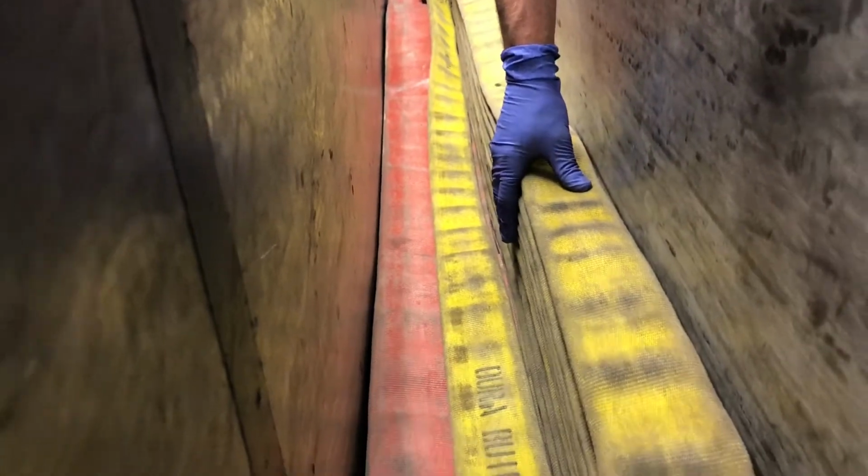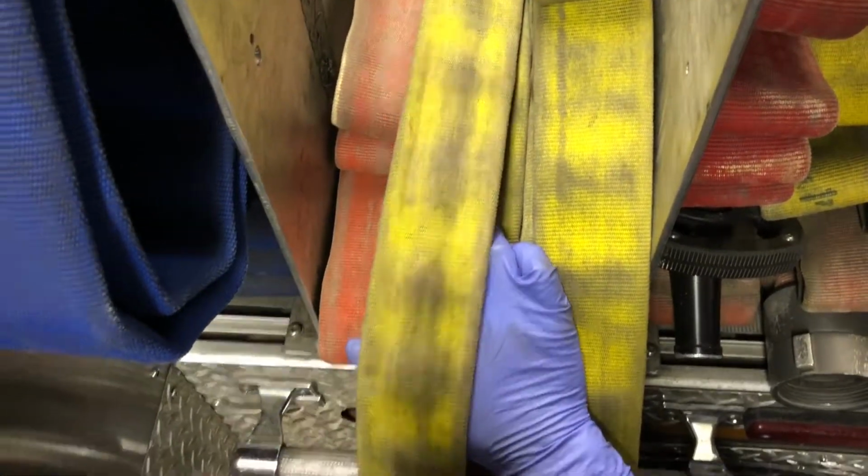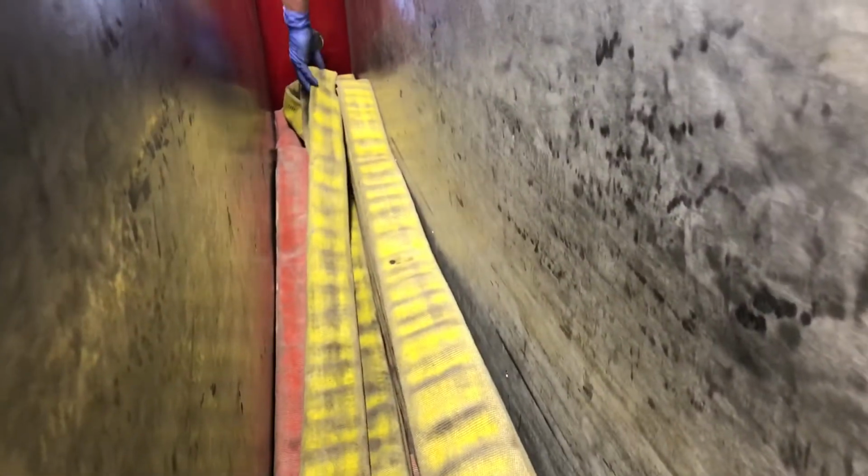The coupling in the back third, hose coming straight down the middle, following the same pattern. This stack is often the most challenging to load. It sits directly in the middle of the 2.5, which may be uneven. Additionally, the 1.75 inch stacks want to tip over unless you keep them in place. It is important as you go to reach down and keep them clean and make sure they are straight.